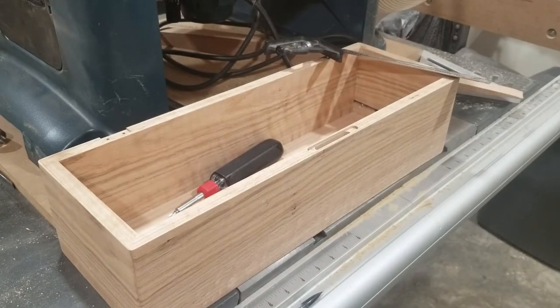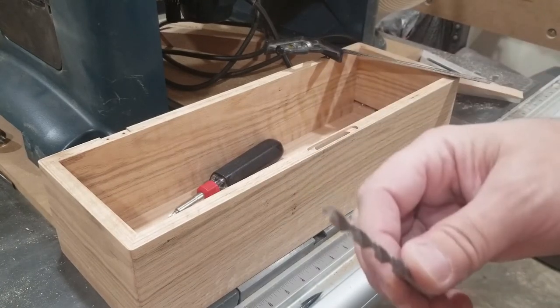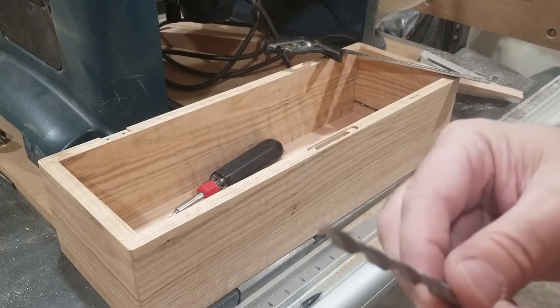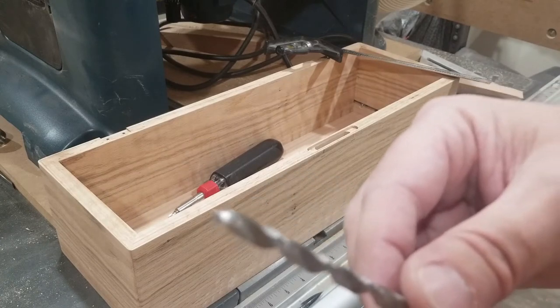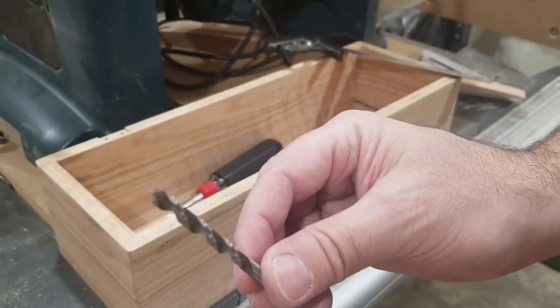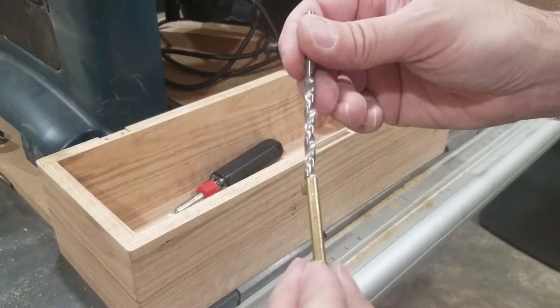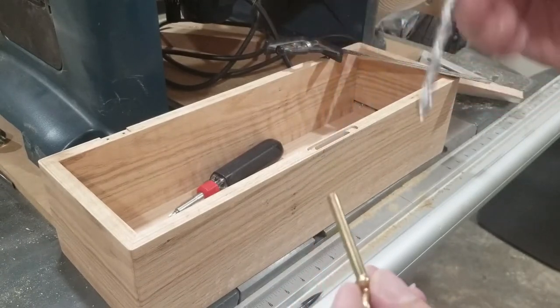You know what? We'll see if we can get lucky. And I'll even go one size smaller than that. So we're going to go with a 7/32 drill bit. And these, if you don't have a set of these with the true points on them, it's just so useful to have these with the actual points on them to get us started. So anyway, we're going to drill a hole,